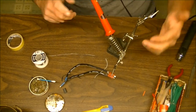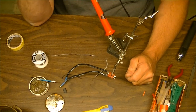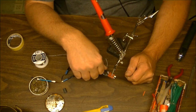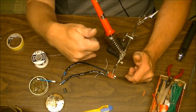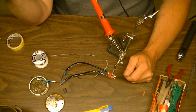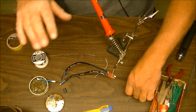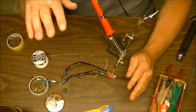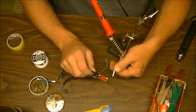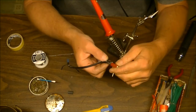When you're doing wires from a battery, this gets really delicate — especially with LiPo batteries. If you're heating the wire up to the point where it's super hot, that's not a good thing, because that heat can travel through the wire and disconnect your wire from the inside of the battery. So if it starts to feel hot, stop and let it go cold before you reattempt. Too much heat is not going to be a good thing.